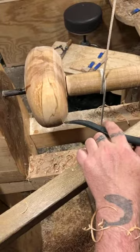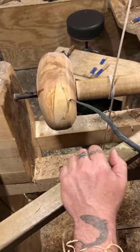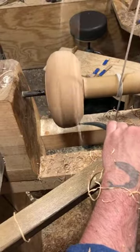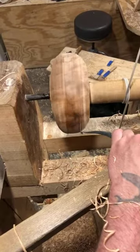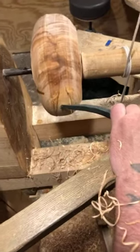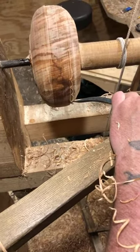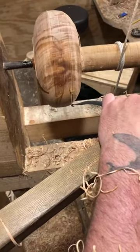Aiming 10 degrees from wherever the tool touches. I can be down here — 10 degrees. I can be up here — 10 degrees off. Here I can't get the hook under the wood, but here I can with a twist. And as I move across, the more I get from 10 degrees toward 90 — 90 will catch. So I've got to be mindful not to go past maybe 20 degrees or it'll start to grab.